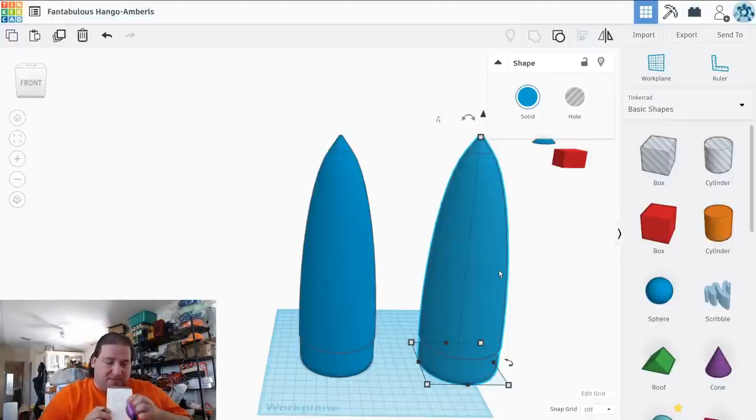you have two different surfaces, okay? Now, how do I make those surfaces join together so that they're one continuous surface? You put a cut in it. You cut a slot between the inside and the outside surface. Now you've made it one continuous path. It can draw the outside, move in, draw the inside, move back out, and continue drawing the outside. In, out, and you have vase mode.